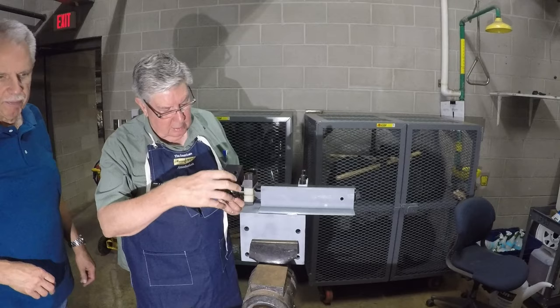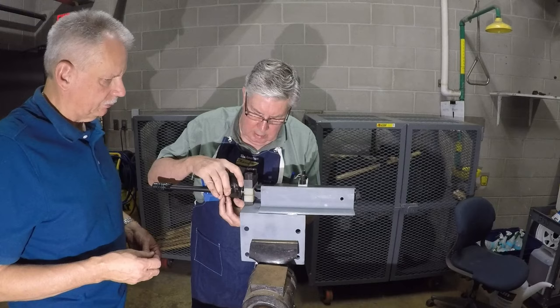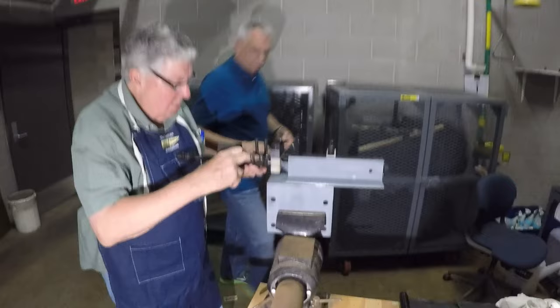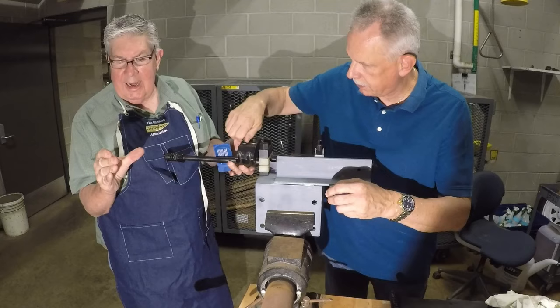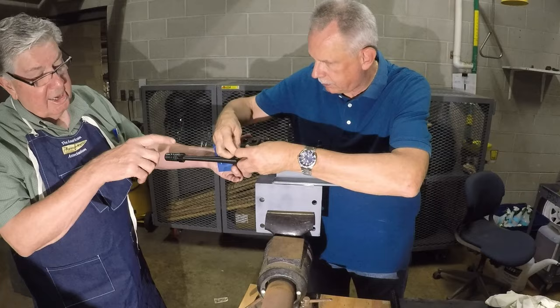All right, so we want to get this in the down position because we're going this way. Correct. Pieces of emery cloth touch, or maybe overlap slightly. Overlap just a hair, if you can. If they don't quite touch, that's okay too, because when you tighten it down, it's going to push it together. But you don't want a quarter inch gap. Now this is where the light's going to come in handy, because we've got to look at that witness mark to get it to line up again.